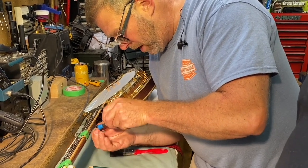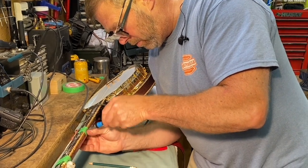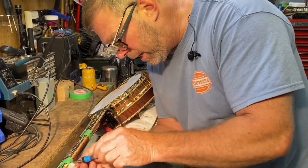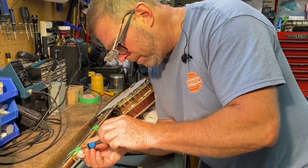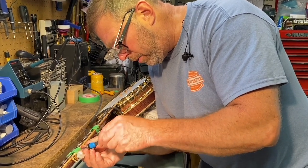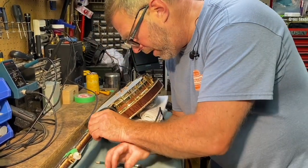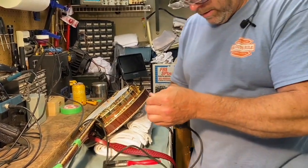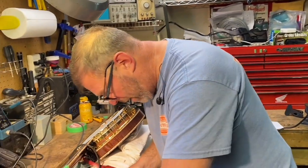Okay, so I'm feeling pretty promising. Actually, I want to go up in the bottom of the hole just one more number size, because those are getting a little tight in the hole. That was a warning from the manufacturer. That's what's going to end up pushing the binding off and everything else in the end if we're not correct. So we've already got our number 55 drill here.